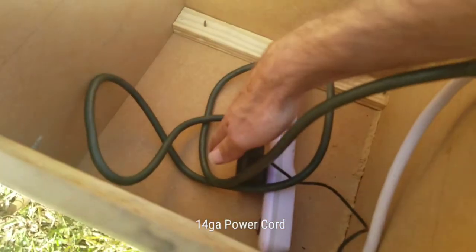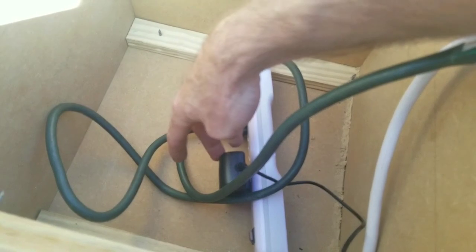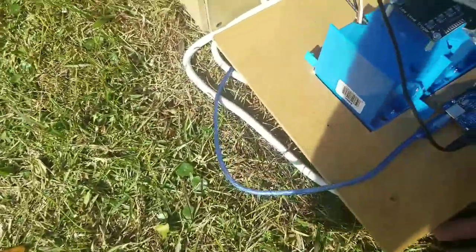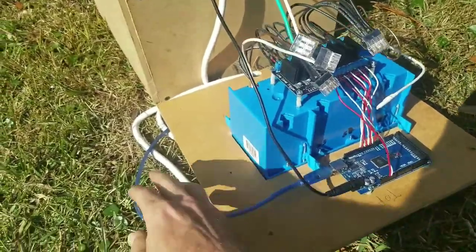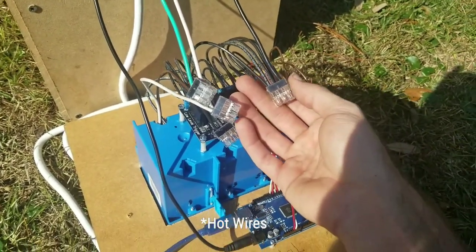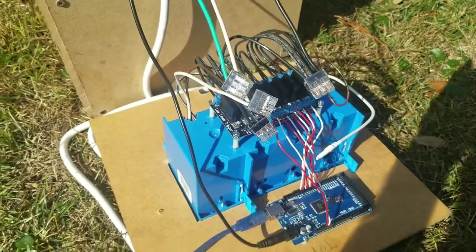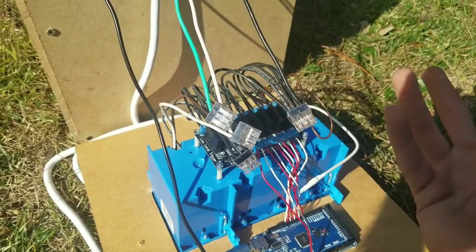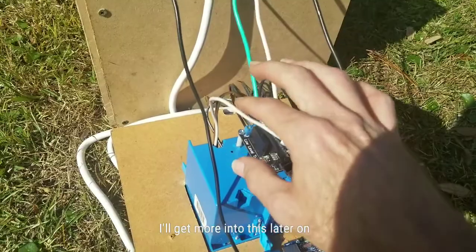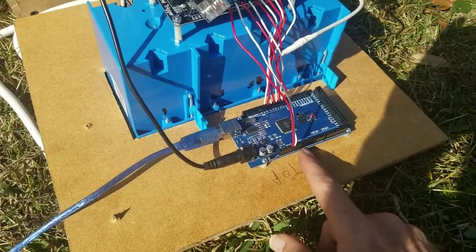Off that power strip comes a power cord that goes to the back of the box. I also have this AC to DC converter that goes down to 12 volts and will put out up to 2 amps, which is plenty enough for what I need. Now here's the guts and brain work of everything — the power strip comes in and all my common wires are connected via these Wago connectors. You can get a box of 25 of them off Amazon, they're cheap, a whole lot easier than using wire nuts and you can reuse them.